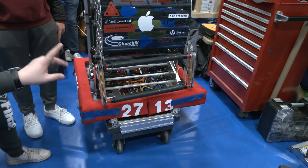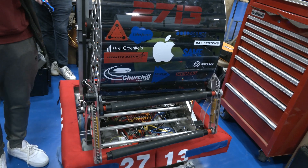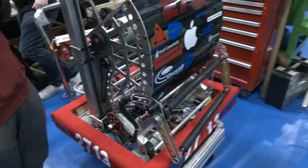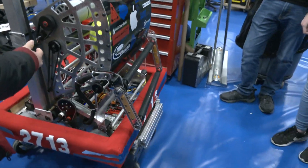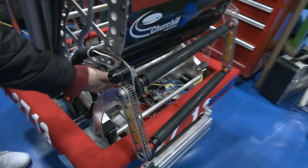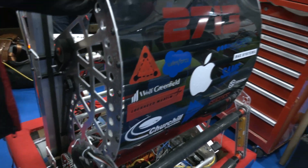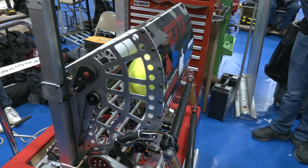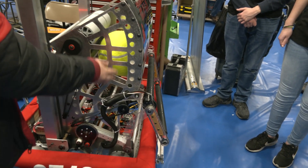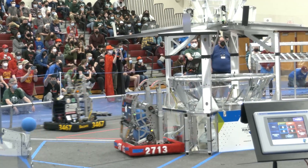As we continue through this robot, we're going to go into what's called the indexer — an S-curve going into the robot. Talk to me a little about the S-curve, some of the design and thought process on that. It's an S-curve — you bring the ball up through the robot. We've got mini NEOs running on these, one per each roller on the inside. One side brings it up from the intake to the upper indexer, which brings it up toward the flywheel. We've actually got some really interesting autonomous code using sensors there to automatically bring it up from the intake toward the upper bound and make sure everything's full and as close to the flywheel as possible, which I'm very proud of.